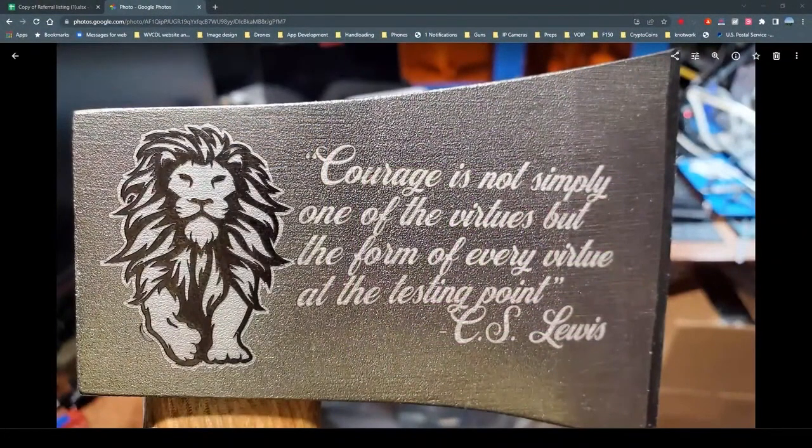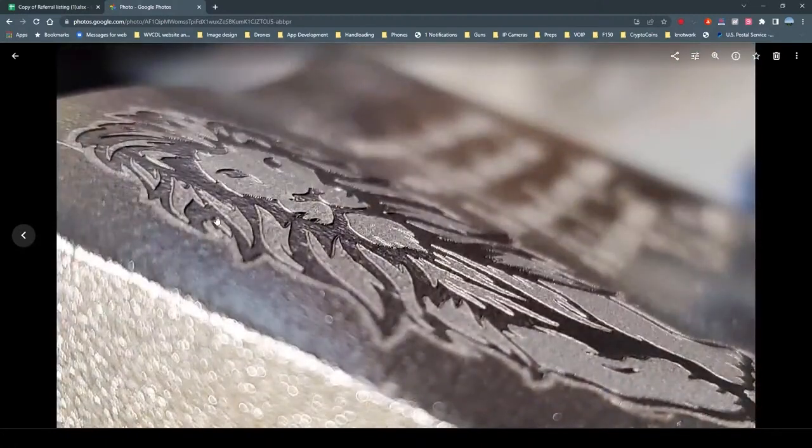Then you can get into messing with your vectors and your different cut layers and doing colors. Even with a non-MOPA, if you wanted to do a silver and black combo with an anneal and a lighter engrave, then with your silver or white, make sure you put a clear coat on. But I did that one in two different layers and had one deeper than the next.